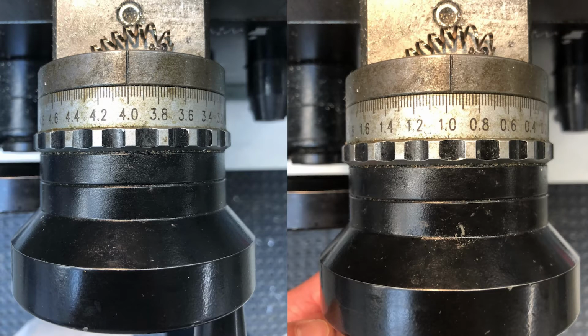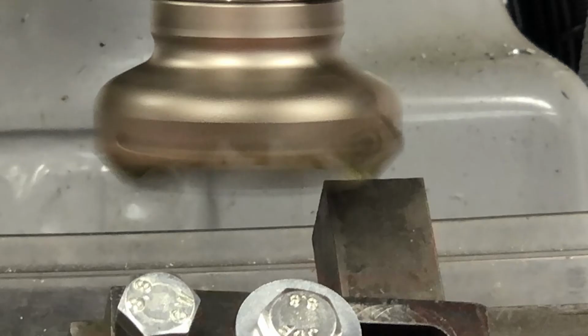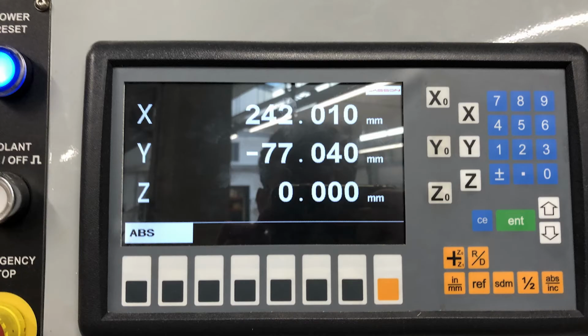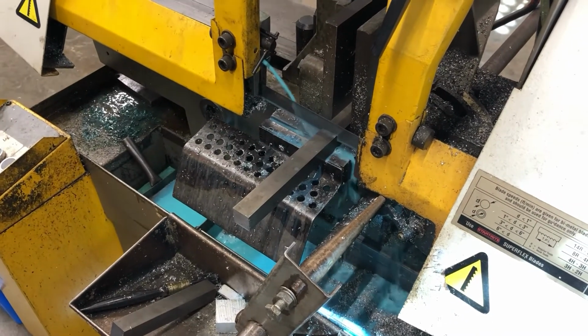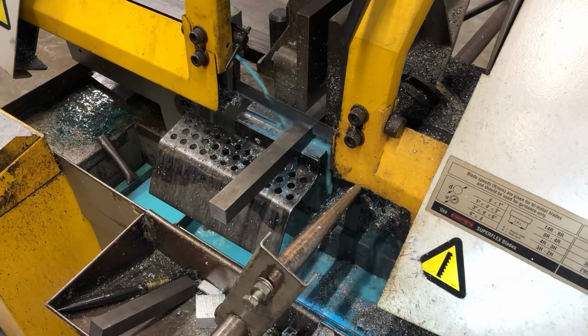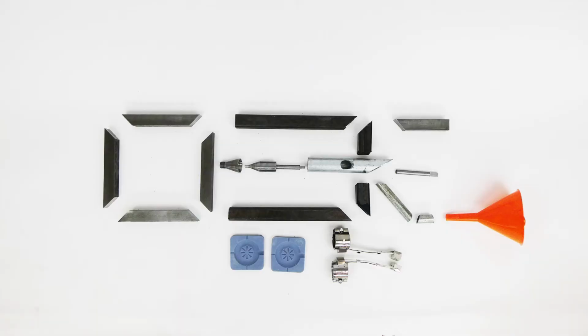On both machines, you move the part in relation to the cutting blade using X, Y and Z axis wheels until the cutting blade intersects the part. You then set the value to 0 on the control panel for the respective axis you are moving the part in. The remaining parts of the frame of my injection moulder were cut on either a bandsaw or a chop saw. The next step was welding these parts together.